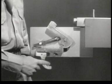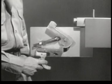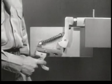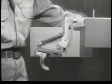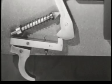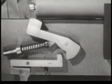When the trigger is squeezed, the nose of the sear slips out of the notch and the hammer is driven forward against the firing pin. This mechanism, like the other one, can be cocked simply by opening and closing the bolt.